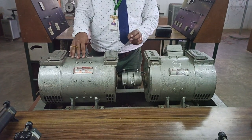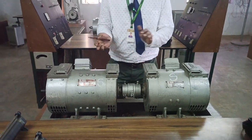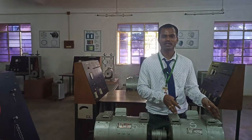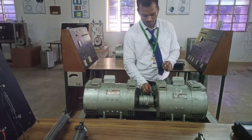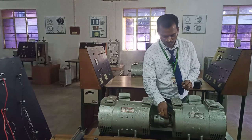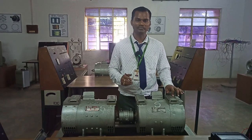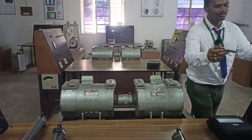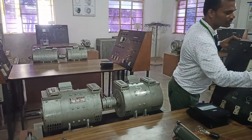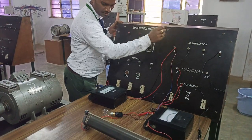The DC motor consists of a stator made up of a field winding and a rotor made up of an armature winding. The reverse of a DC motor is nothing but a synchronous motor. Here you have the stator as well as the rotor — the rotor is nothing but the field winding and the stator is the armature winding. The EMF you can collect across R, Y, B terminals. This is how we are collecting the EMF from the terminals, brought out where we have R, Y, B.